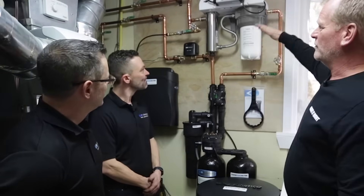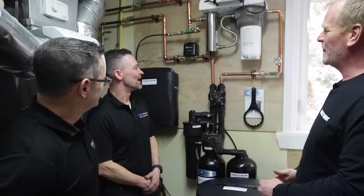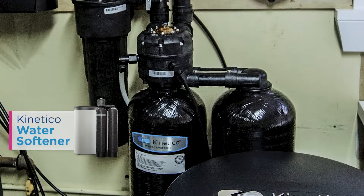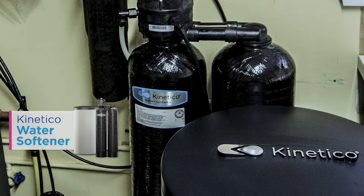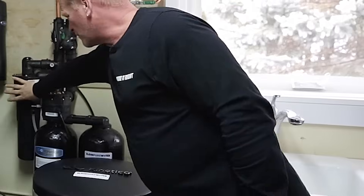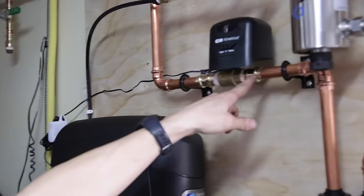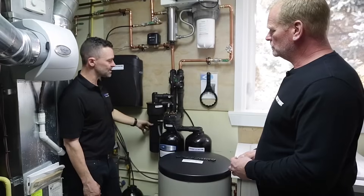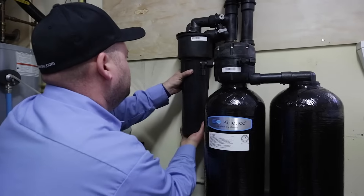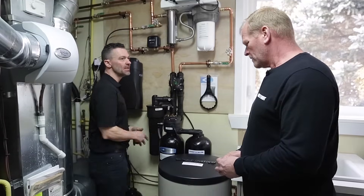Dan, this is totally neat and professional. I can tell you love what you do. Tell me a little bit about this place. So what we've got here is your inlet water coming in, which initially goes through a valve we'll talk about later. From there we come into the Kinetico S250 water softener — this is our twin tank non-electric high efficiency system. The water comes down and the first thing it hits is a 20-micron pre-filter to capture any sediment, silt, sand, or anything 20 microns or larger, protecting the inner working components of the valve and the media inside.